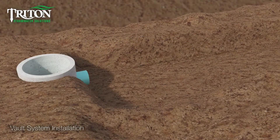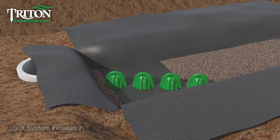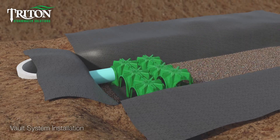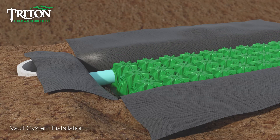With a hole dug and a minimum 6 inches of stone applied, the main header row sediment barrier is set. Outside perimeter end caps are cut to accept any inlet pipes, and inner end caps are cut to set the main header row water treatment elevation. Vaults are set in place and end caps are added to block off the perimeter stone from entering into the vaults.